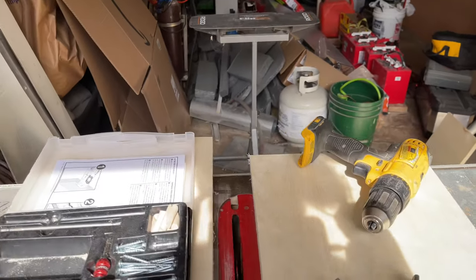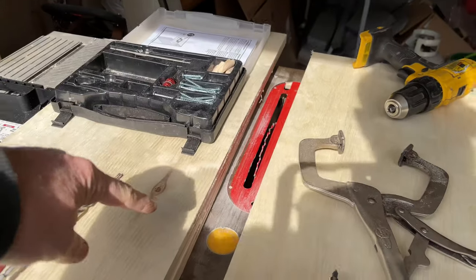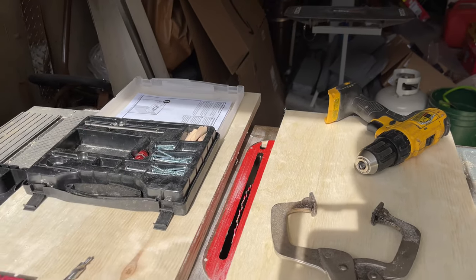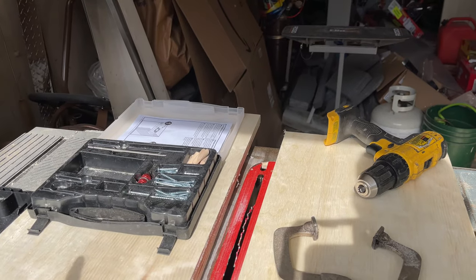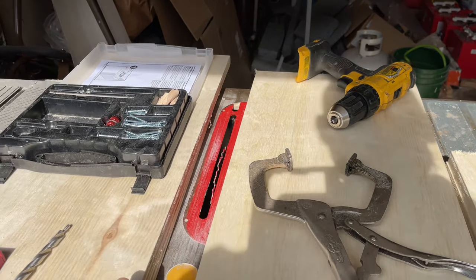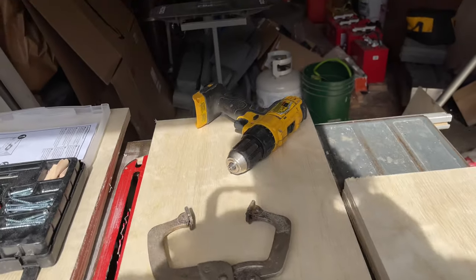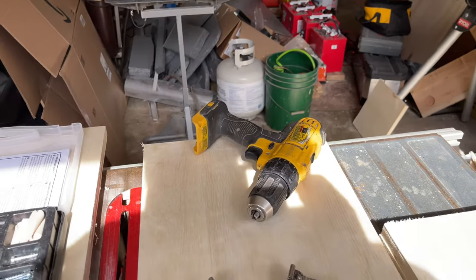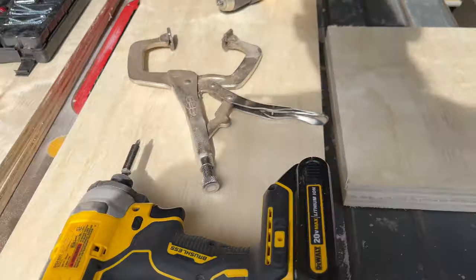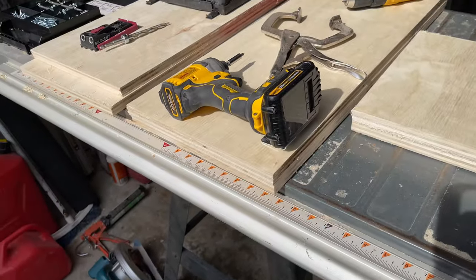And then what I'll do is in the bottom, I'll drill through to the bottom of the trailer and have a little pipe in there. And that'll provide fresh air in and then the fresh air out. Because with these sealed boxes, you have to make sure you have ventilation. It's not a glass mat battery, so this is how I'm going to do it. It was fairly cheap to do it this way compared to buying glass mat batteries.